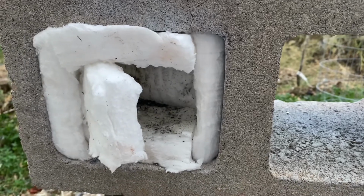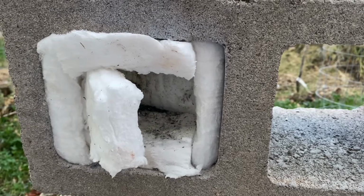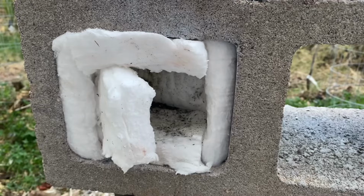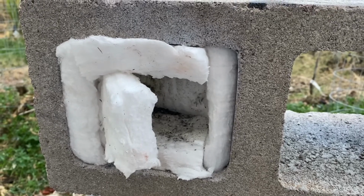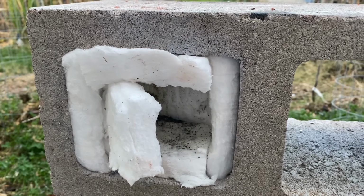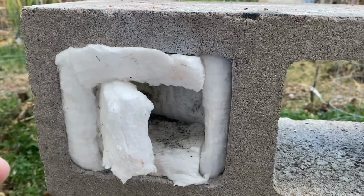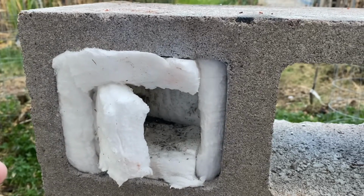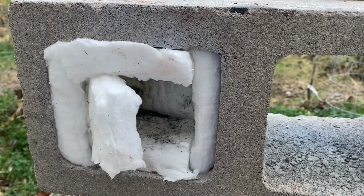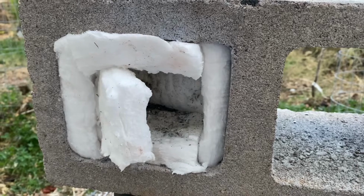I actually tried doing this just on a crucible with just my blowtorch blowing into it. And initially I started with brass. That's what I was experimenting with. And the problem is brass doesn't get into that temperature where not only is it molten, but it's very flowy. When you try casting a ring and you don't get the metal quite hot enough, it doesn't flow into the cast properly. So if you have that problem where you're pouring your metal and it's not filling your mold all the way, your metal's probably not quite hot enough.